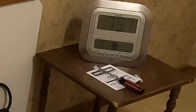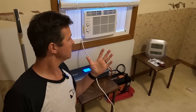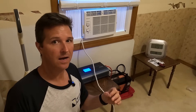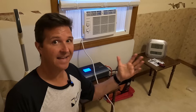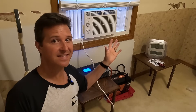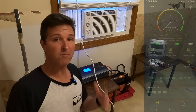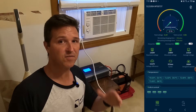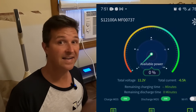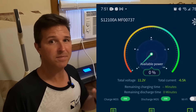It is now 7:50, so this has been going on for a little over three hours. I've noticed that in the last hour the air conditioner has been maintaining the temperature a lot more than it had in the first two hours. While the condenser is running it runs at about 38 amps, which is about 450 to 470 watts, but right now it's only on the fan and running at about 6.6 amps — which is about 70 to 80 watts. That's a big difference, and if it can maintain by just running the fan, it will be a lot more efficient.